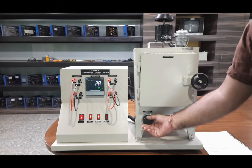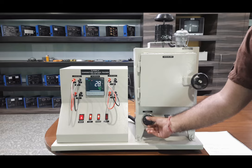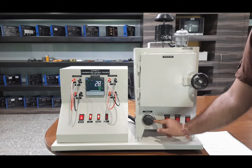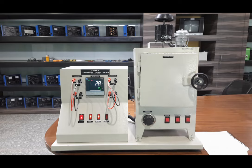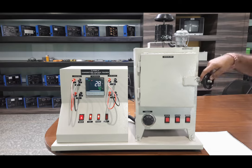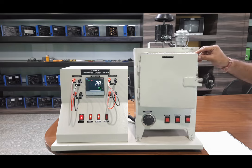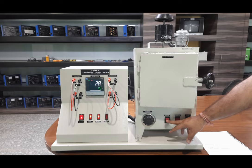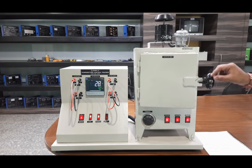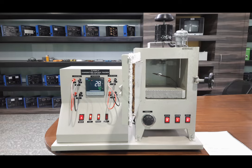We need to set the thermostat value to about 180 degrees. Starting from 50, we turn the knob to about 180 degrees — the thermostat is now set near 180. Also, as mentioned, just open the door about 20 percent so that air will circulate properly inside the cabinet and it will not heat up beyond the desired limit. We will slightly open the door and then turn on mains, heater on, and fan on. I am just opening the cabinet to show the fan working inside for this video demonstration.